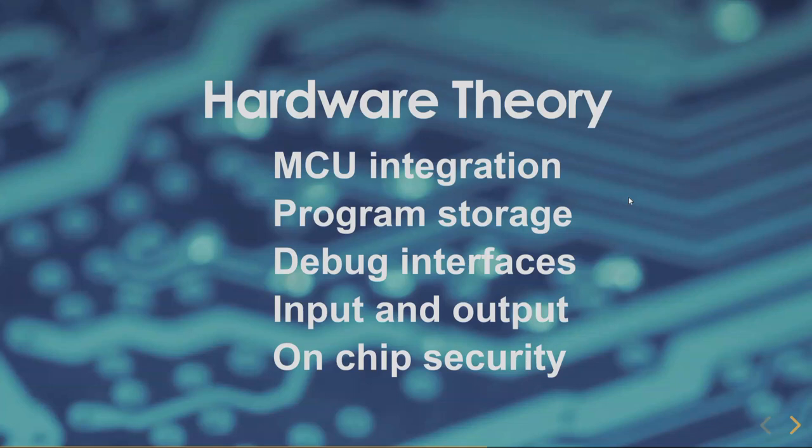When doing PCB engineering, each of our devices has an MCU — microcontroller unit. We're not doing much with MPUs or high-power 40-watt TDP platforms. We're doing everything very low power so battery power is an option. We're using ARM-based microcontrollers — Cortex M3 and M4 — but considering other platforms. On secure storage, the physical chip has a mesh which makes it very difficult to decapsulate with sulfuric acid.